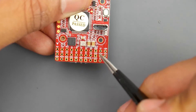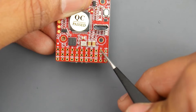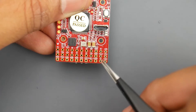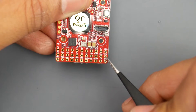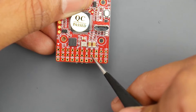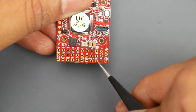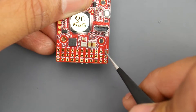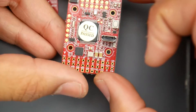For other peripherals: if you want to connect a buzzer, put the ground here and positive there. For the VTX, which is nicely thought out, you have VTX signal, battery voltage, ground, and SmartAudio. Camera is right below with cam, 5 volts, and ground. Then there's LED with 5 volts and ground — the LED pad is the signal that will control your LEDs.